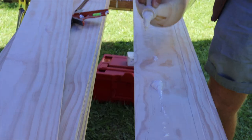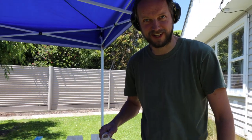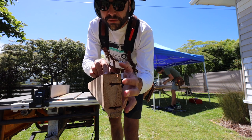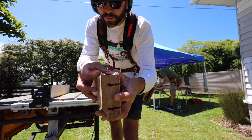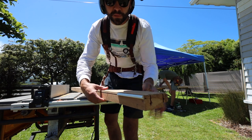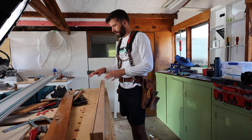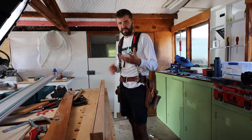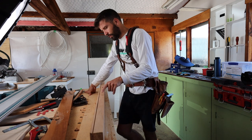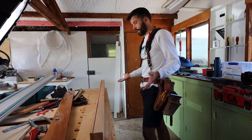I found some old glue in your cabinet. What's wrong with it? Nothing, it just looks like custard. One of the advantages of building the door frame from scratch is we get to cut in the weather grooves — I had to retrofit it on the bedroom window, but now we can do it from the start. This is going to be the sill — that's the bottom there — and then the sill is going to be glued on there. In terms of cost, this is a lot of work and I don't think it is cost-effective. So if you're thinking about recycling a door to save money, that's probably not going to work out. But if you want to do it just because you like the idea of recycling old stuff, well this is a great option.